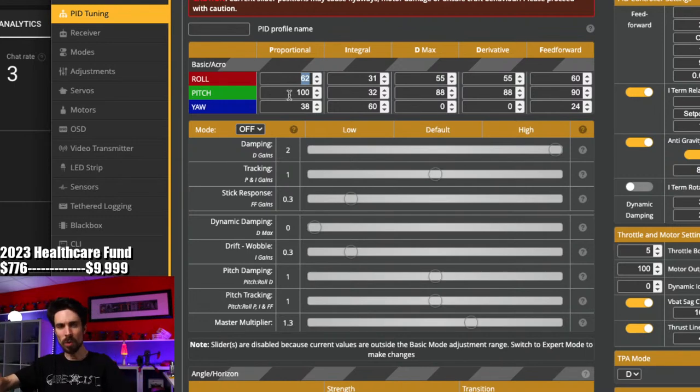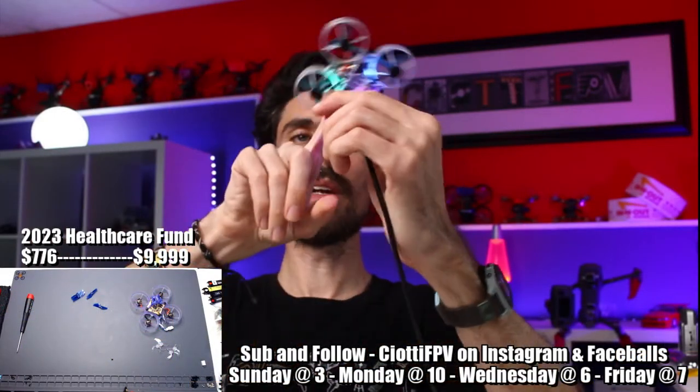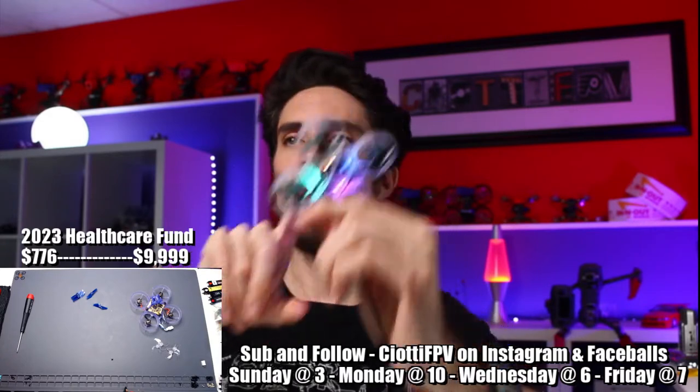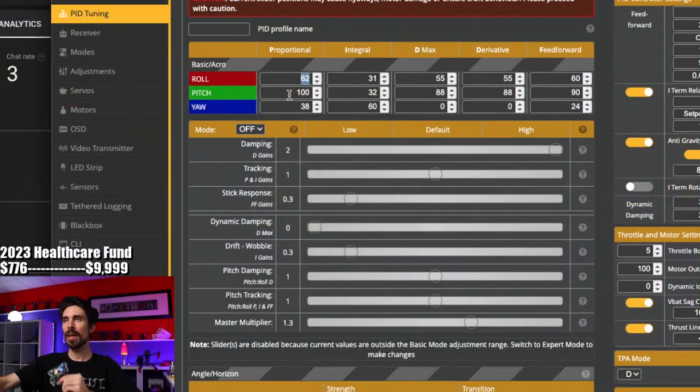So on a tiny whoop, you do have a little bit more weight on the pitch axis because your battery is on the pitch axis, right? You put the battery through the middle and the bottom there. So it is good to have a little bit more pitch authority with P gain and D gain than roll. But this is a lot. This is like twice as much.